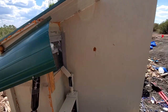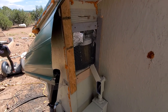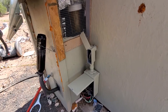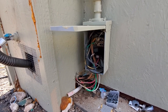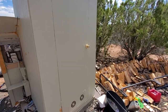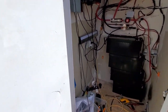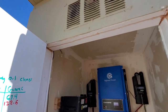I had it set up with a little muffler so all the exhaust would go out, and I recently cut a hole for heat to exit because it was getting really hot. There's wiring going to the house underground here with 70-amp breakers going in, and a shutoff switch in the back of the house. This is a 4x4 building I made specifically for the Tesla batteries, which is also good for lithium polymer. It has a temperature-control fan — if it gets above 90 degrees it turns on. It's 113 degrees right now.